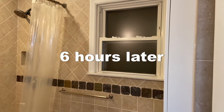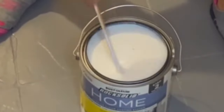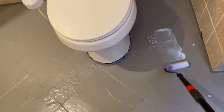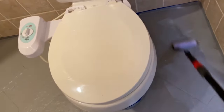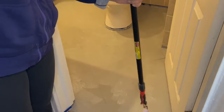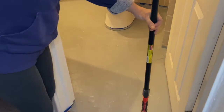It was dark outside by the time I came back 6 hours later and the paint was dry. I would not step on it with shoes — just socks would be fine. This is the top coat; it has a white milky color, but it is going to dry into a clear coat, so don't worry about the white streaks your brush or roller leaves behind — they will all disappear by the time it's dry. There are two finishes for this top coat: matte and glossy. Mine is matte finish — I don't want too glossy, especially in the bathroom, as a glossy finish isn't that safe. I wouldn't use the glossy finish anywhere, really.